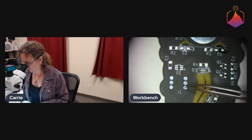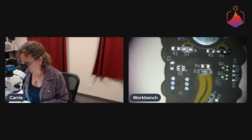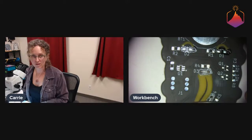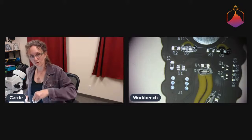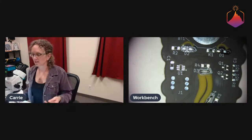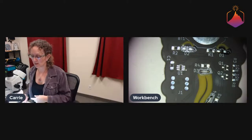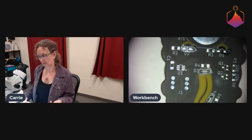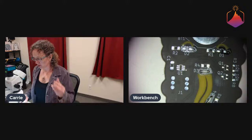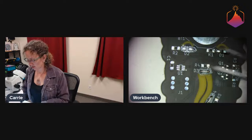And we did something kind of clever here. We didn't have a ton of room. It would have been really hard to shove on a bigger programming connector, like connector pads. So what we decided to do is make it pogo programmable. We made this little pogo adapter board as well, which is about to be in our shop. It takes either a 10-pin or a 6-pin cable version, so you can just plug in whichever programmer you have, and then it breaks it out into these pogos.